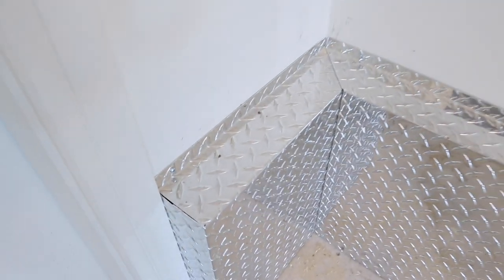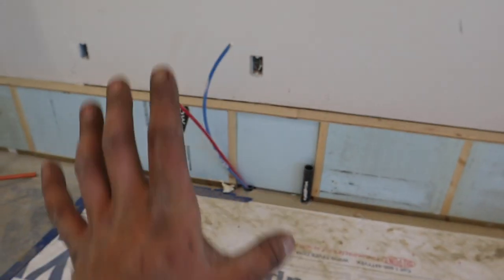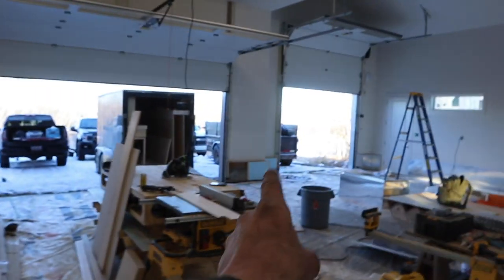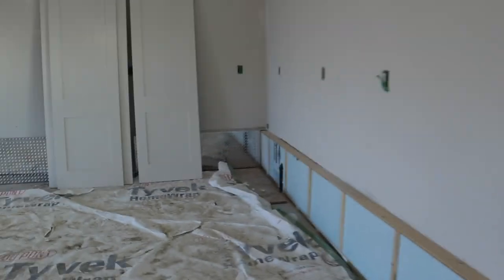Chunks of metal are flying and we are mitering. It's looking really good — corner's mitered. I'm just going to lock this other piece in, cut out, make a little box around that. There'll be a finished panel on it after, and then miter up to the stairs. That side's done, that guy's pre-bent sitting right there, that whole run is done. We're just going to get that run to the door and we're done. Silicone all the joints and we'll be good to go.